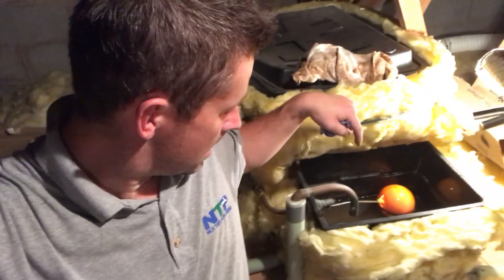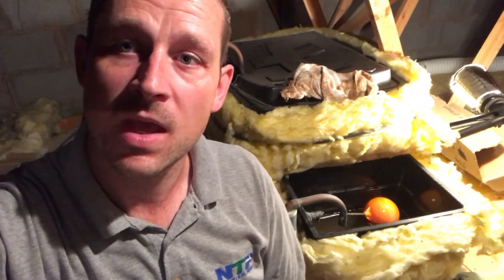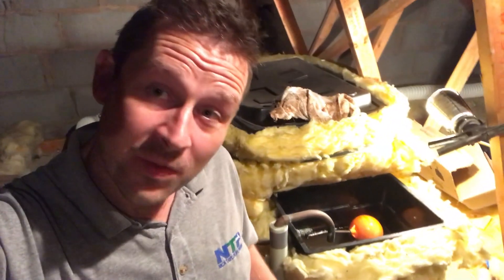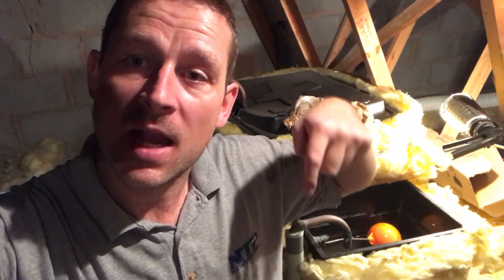Something which is really important: the tank beforehand was absolutely filthy — filled with rust and all the debris which builds up in your radiator system and comes up here. So I've cleaned that out. If I didn't clean it out, when I filled back up all that rubbish is going to go back into the central heating system. If you don't clean it out, it gets stuck in all the pipework, especially on an older system where the microbore pipework is only 8mm or 10mm. It's really important to clean it out, because you don't want to waste a day trying to unblock something which could have been prevented so easily. I'll put a YouTube link at the end so you can see how we do that.